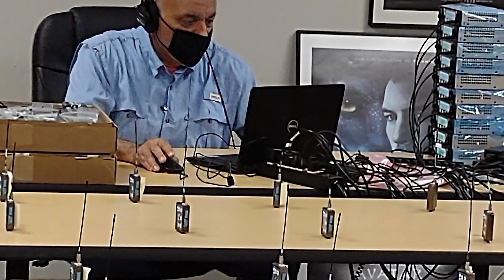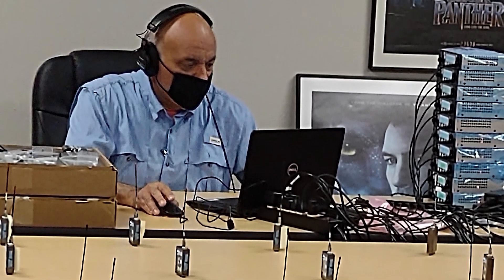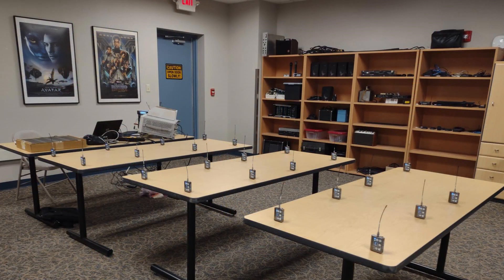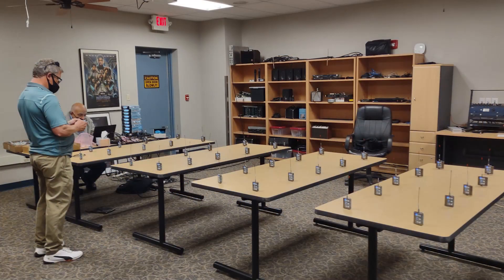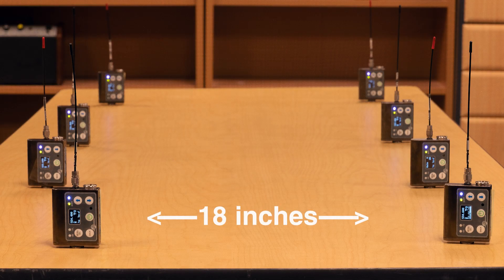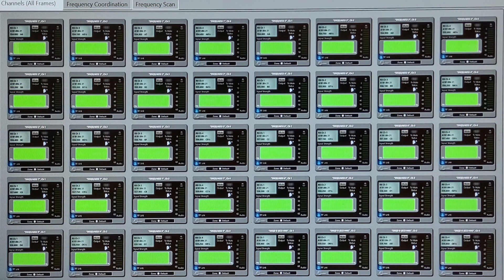Because of this, carriers can not only be closely spaced but also evenly spaced. For our tests with actual systems we started with 24 DBSM transmitters, then did a second test with 40 transmitters, all placed 18 inches apart, all together in one room. We spaced the carriers evenly at 200 kHz apart and still had normal operation. In some situations even closer spacing might be possible, but operating range is reduced depending on external conditions.